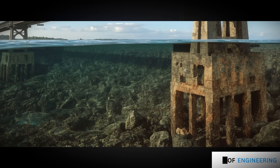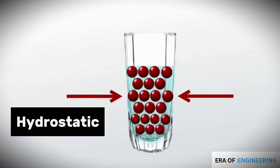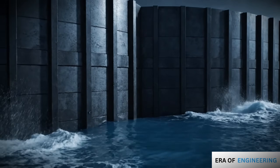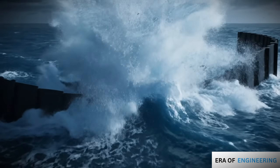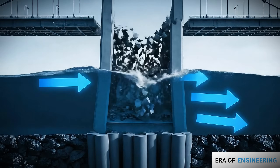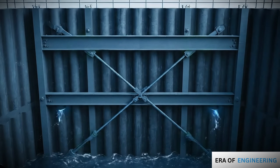Every part relies on the underwater foundation. One critical issue is hydrostatic pressure. According to Bernoulli's principle, water naturally flows from high pressure to low pressure. When water is pumped out of a cofferdam, pressure outside is higher than inside. Without reinforcement, sheet piles would collapse inward. To prevent failure, bracing systems and tie rods provide lateral support. Dewatering is done gradually, never all at once. Pumps remain active to manage leaks until permanent sealing is complete.